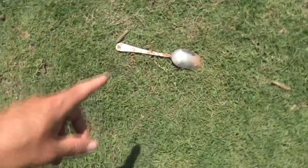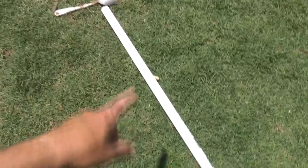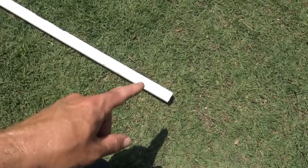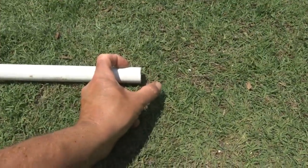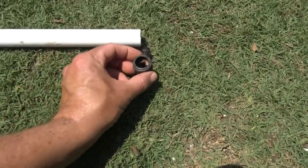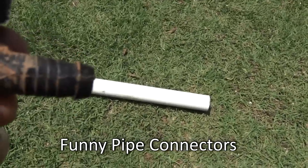I'm going to go real high tech on you here. That spoon is the main water valve at the street. From there, you're going to run — there is basically PVC pipe underground, and that goes up usually to your valve station. This pipe will run underground throughout your yard in different areas. You'll basically have either three-quarter inch or one-inch PVC, Schedule 40 usually. At certain points, they're going to tee into this PVC and put some kind of little connector valve.